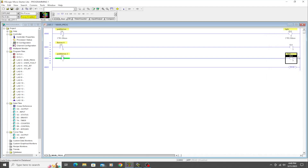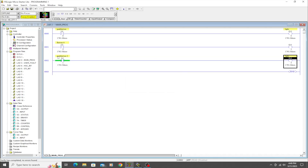We'll just name this output 'Light.' After verifying, the project checks out. So for the Examine If Closed rung: push button four (input I:0/3) goes high, it passes logic and turns on output O:0/2. For the Examine If Open rung: if the input is not high, it passes logic and the light stays on — and if you push the button, it actually turns the light off. It does the exact opposite.